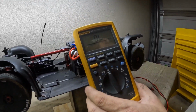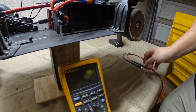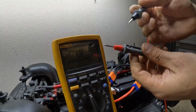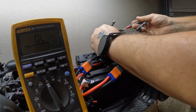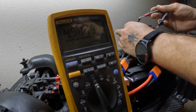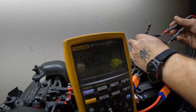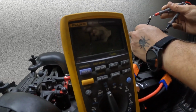We have a multimeter right here set on ohms, and we're going to ohm out the motor. You see what your resistance is between all the leads. When we touch these together, you see that it's 0 ohms. Between every single one of our leads, we should have 0 ohms, or about. Maybe 1 ohm is still okay, but for the most part, it should be a dead short. So we have 4 megs there, 4 megs there, and 75 ohms there. So the motor is completely toast.